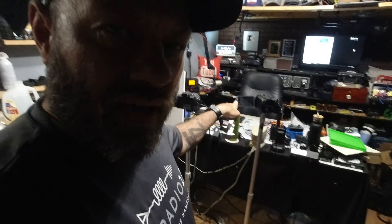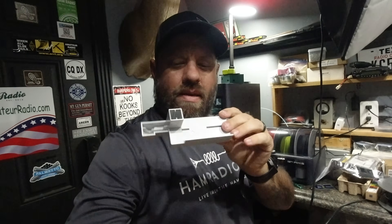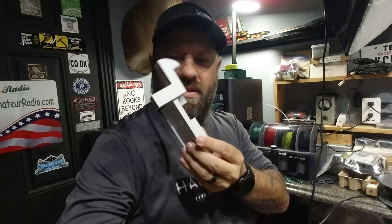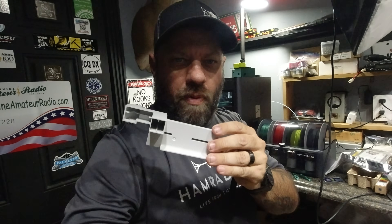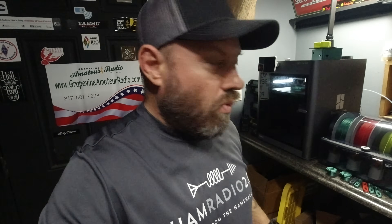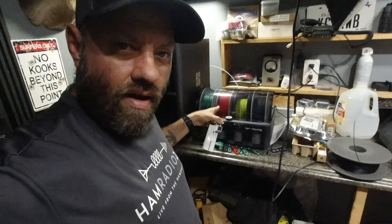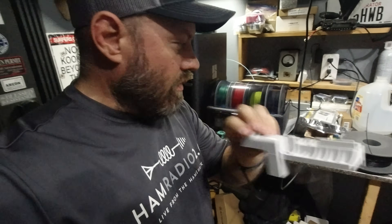I was sitting at my desk during a calibration run and heard a crash — the door had popped open and something had fallen on the floor. I emailed Glenn at GigaParts and asked what it was. He said it was probably a brace for packing material that I should have removed earlier. I hadn't realized it belonged out. After removing it and running another calibration, I tried the Benchy again and it came out perfect. So the two problems were: AMS not completely filled, and that packing brace still being inside.